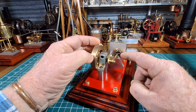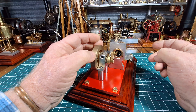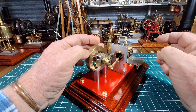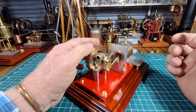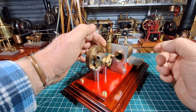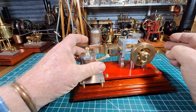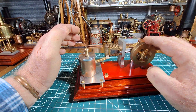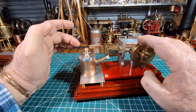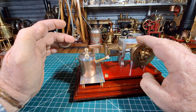It's a steel piston in a brass cylinder. There's a ball bearing that the cam works on. That spring operates it. You can see — the flame gets sucked in there, comes and closes, cools down, makes the piston go back, sucks in some more flame, cools down.